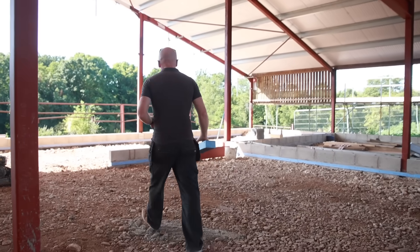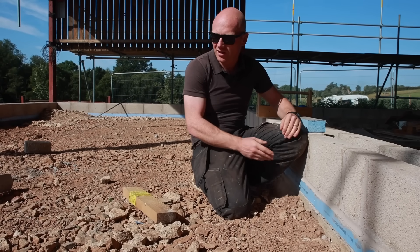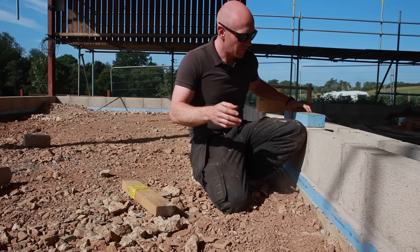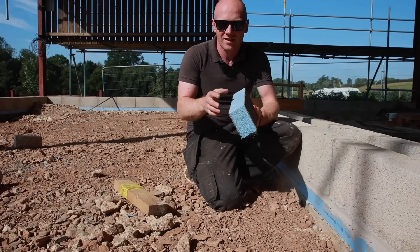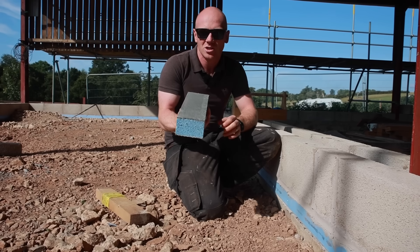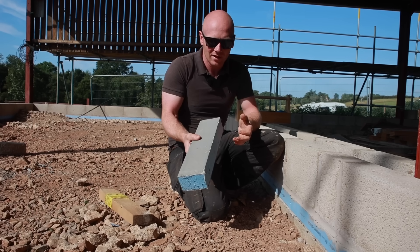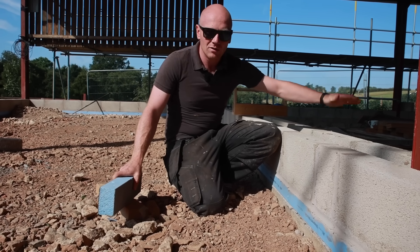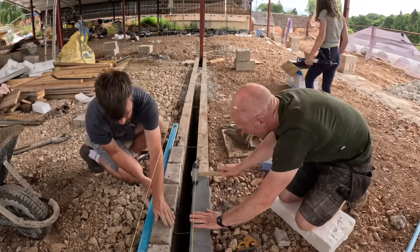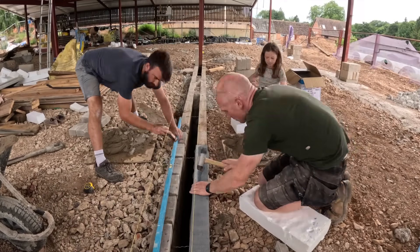Let me show you it in practice — let's pick a warm bit in the sun. You can see that blue line that cuts through the whole building and just isolates everything from the ground. The blocks are in place and the easiest thing to think about these is they're just a brick — exactly the same dimensions, laid in exactly the same way. On the outer leaf, which is outside the thermal envelope of the house, we've just put a concrete common block which is the same size.